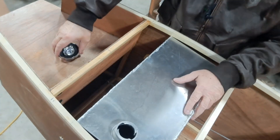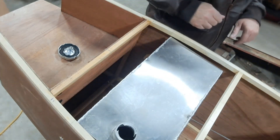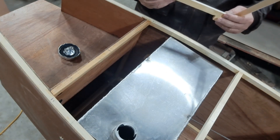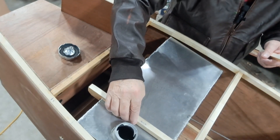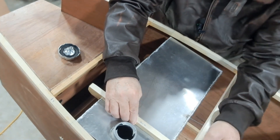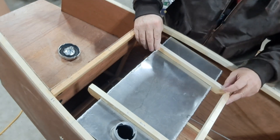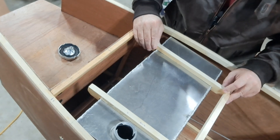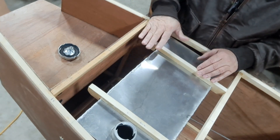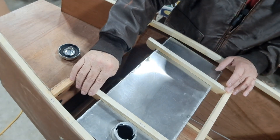It's really holding me up — everything just keeps holding me up. This is the height of the tank. You get these two pieces here, put them in there — one there. These will end up gluing to the underside of the deck when it goes on. Right now I've got them flush — you can run a straight edge across here and they're flush. Glue up good.